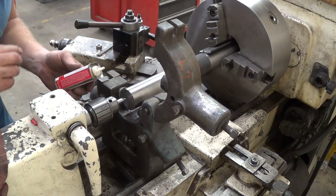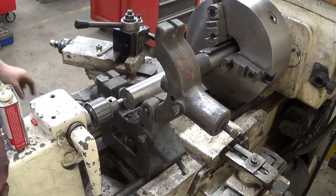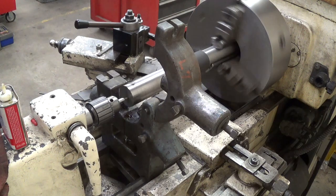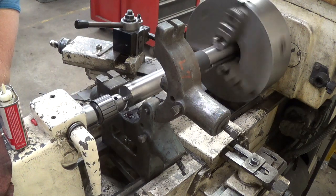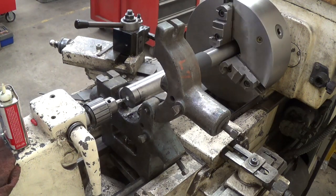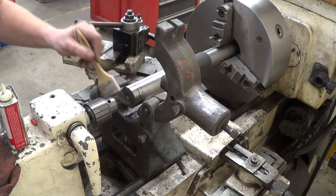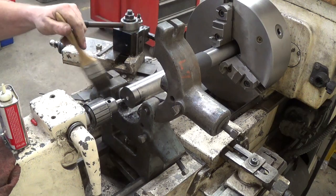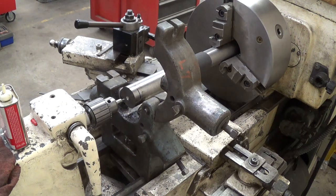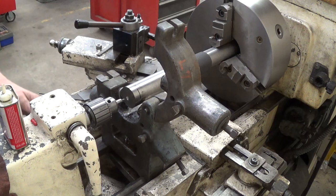I think I'm ready to go ahead and attempt this. I'll put a spot of oil on my bit, some on the end here. Kick this off — my needle will come in really slow. Looks pretty good. I have a really nice center drill mark here. That's going to allow us to turn this between centers. I'll get one put in the other end — it's going to have enough grab for sure to hang on nice. I'll go ahead and flip this around and we'll do the same thing with the other end.